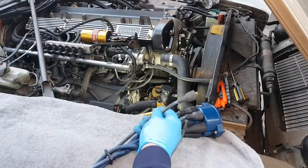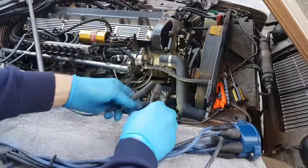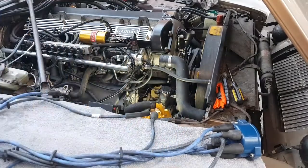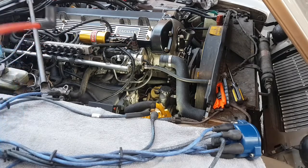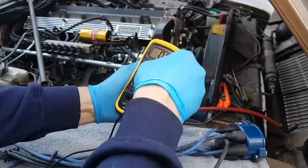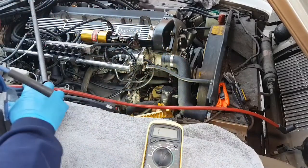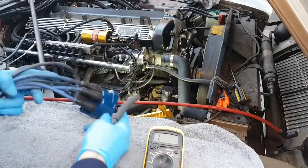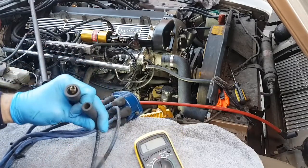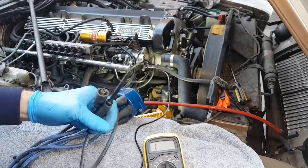Take the longest lead - I'm going to test them all but I'm not going to do it all on camera because it'll take too long. I need to get the longest red one. Right, here it is. Let's get the multimeter and set that up. What I'm going to do is measure the resistance across the terminals. Let's select the longest one - there it is. I've pulled that out, that's the other side of it.